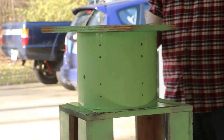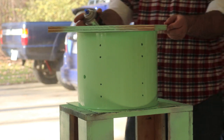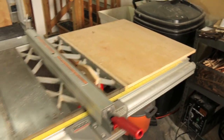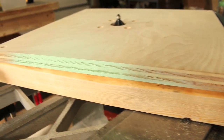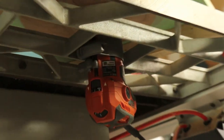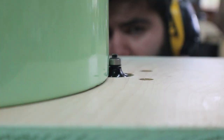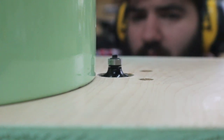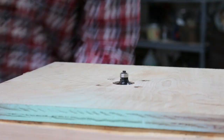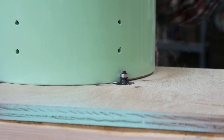You've probably noticed that I've been painting over the bearing edges — I'm going to recut them, but I'm only going to take a really shallow pass so that I'm only removing the paint and not so much the wood. Now if you watch my second channel, you might remember a video where I make a table saw extension wing, and in that video I say I made it to turn it into a router table. I've been waiting to buy a new router since I just have a small palm router right now. So right now I just made a temporary ghetto router table with the small palm router using some scrap wood, put in between one of the holes in the leaf of the table saw. I'm only recutting the bearing edges on the outside diameter of the drum — I have a quarter inch round over bit, but I'm not using the full depth of cut. I have the majority of the bit sunk below the table so that I'm only taking a really shallow skin pass along the drum. And you can also see here why I need a bigger router table.